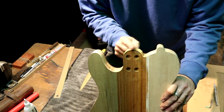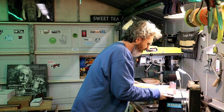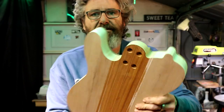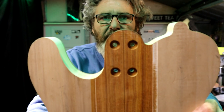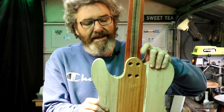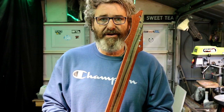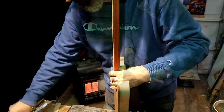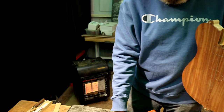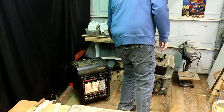I was just trying to knock off those corners right here. I don't want to hit the side of my neck pocket yet. I'll work on the rest of this with files and we'll get that down with some sandpaper — we're really close already. Once we get this exactly like we want it, I can draw that shape on the neck to let me know what to do with that transition. Let's take our pencil and draw this. Not saying I'll copy that shape directly, but now I'll know that is my no-go zone.